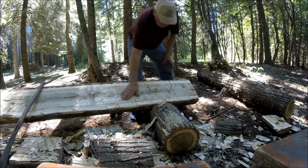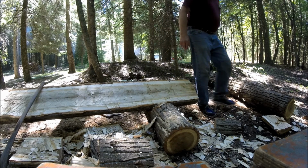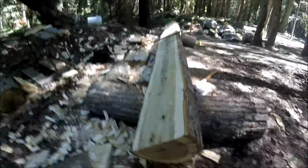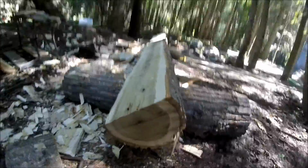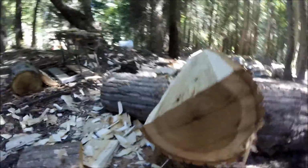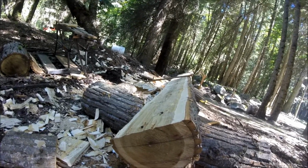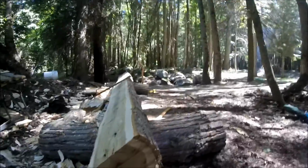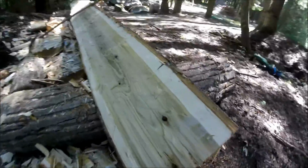Okay, I'm pretty darn happy with my work on that log, and I'm not even exhausted. I don't think actual time was not even an hour on that. I'm sure it wasn't. Anyway, you can see it's down on this end. Got a little bit cut off there that I didn't want, because of the way the grain is. So I'd say if you have stuff that starts to do that, make those cross cuts pretty close together, or chop them down, and that surface is pretty darn nice.